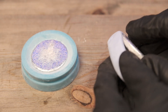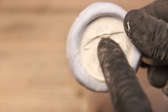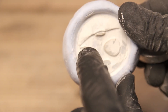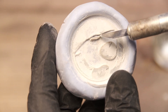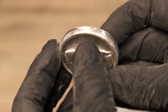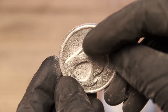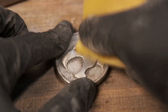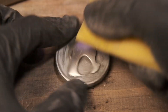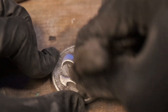I was able to get a passable cast with the mold putty. There's a little problem area getting the metal to go down in between that little space with the eye — it ain't 100%, but the way it turned out I actually really like it. Let's see what I can do with this thing — polish it up. I started out with fairly coarse grits, then moved to about a 220-grit sanding sponge, and then tried some little steel wool to see how that looks.